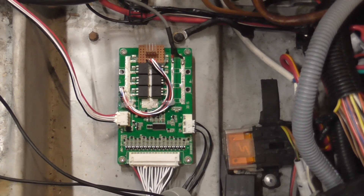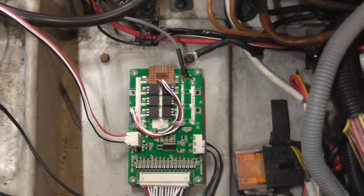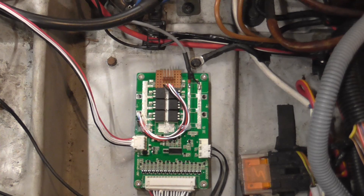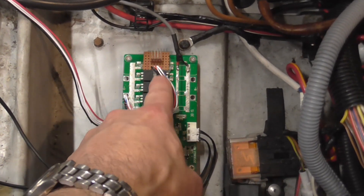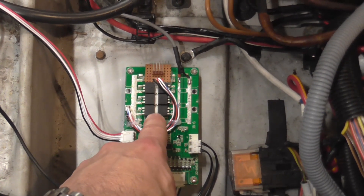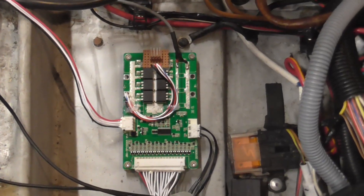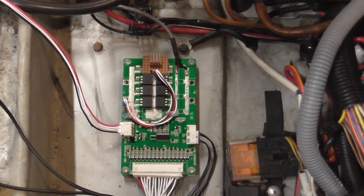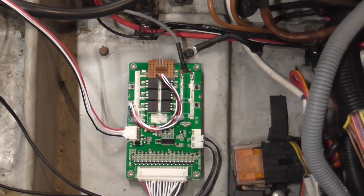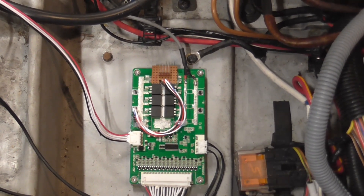I've featured this in a previous video because I modified it. As the application is really only meant for very lightweight stuff — bicycles, power tools — the current flows through this bank of MOSFETs, both for charging and discharging. Now this vehicle is capable of pulling something like 350 amps peak, and by the time you've got a board big enough, that's a bit unwieldy. It's quite lossy, and the BMS unit will disconnect the battery if any cell gets too low while driving, or too high under regen or under charge.